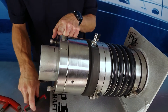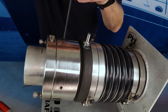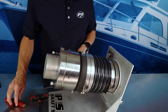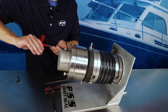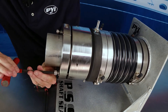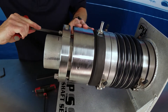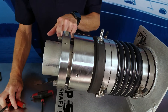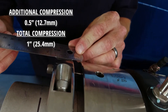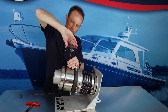After we've secured the clamp to the shaft, we can now remove the set screw that was put in to temporarily hold the rotor in place, and we can leave that in there just off the shaft. After we've removed that set screw, we'll go through the process of tightening the pins again, which will add about a half inch of additional compression. After we've fully tightened the pins, we've moved it again about another half inch, so we're at one inch of total compression at this point. We'll go back to the set screw to temporarily lock the rotor in this position.